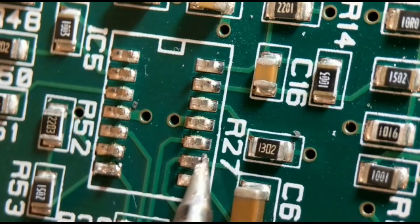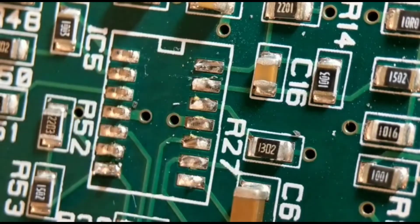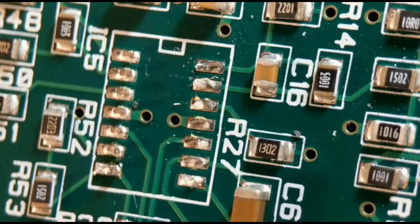There you go — no damage to the board. Then you can go along the legs, clean them up with solder wick on all of them. That's quite a good option — cutting the body off. You can do this with four-sided quad flat packs no matter how many pins, as long as you're careful. Score along the top about three or four times, about halfway down, and you've got the protection of the next leg when using the blade. I've used this method a lot over the years and never done any damage.